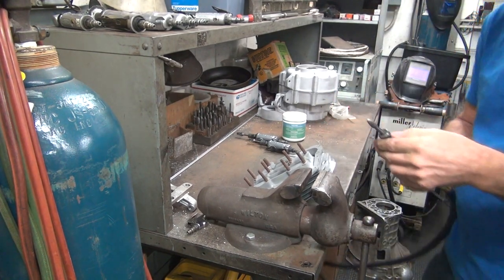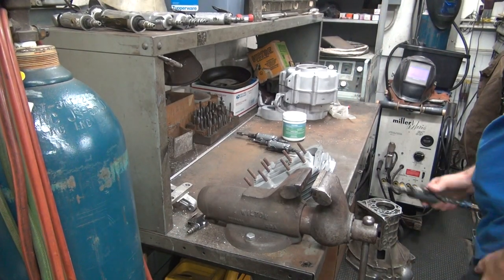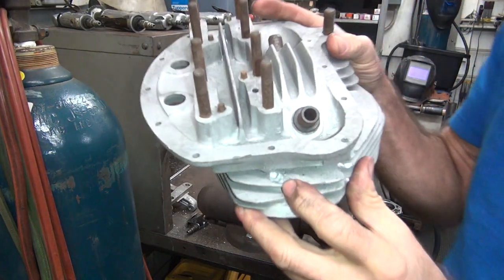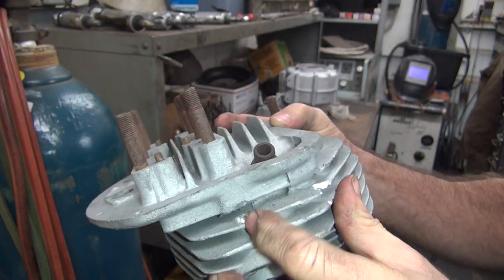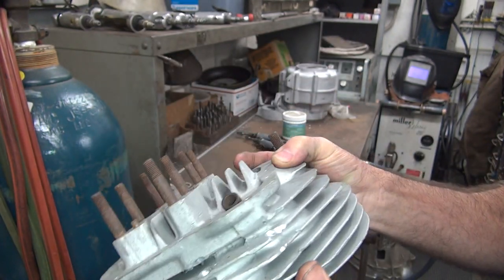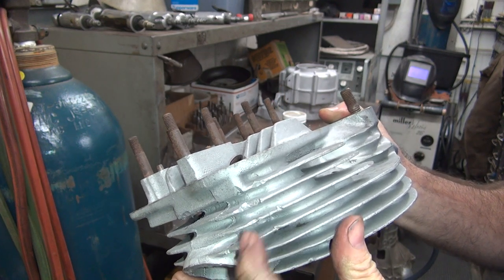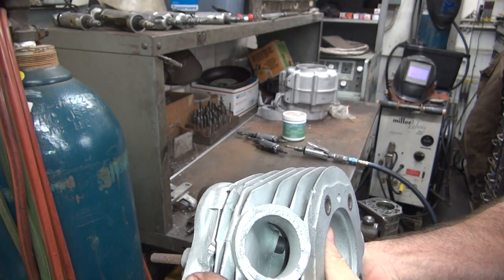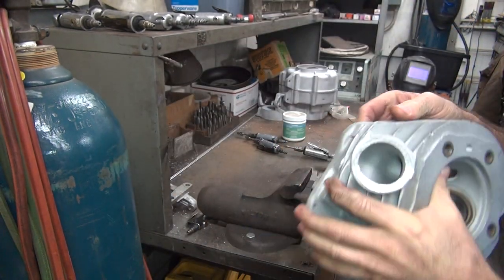Going to unload it a little bit. So you V out to the bottom of the hole, get all the corrosion out so you've got something to weld to. Weld that hole up solid — it'll probably melt this whole front edge away. And then this one here I'll just cut the fin away so I can start right at the bottom. Of course I nicked it right there so I have to tack that now. I'll probably weld it from this side here to clean that up too, because I don't like that sticking out like that.